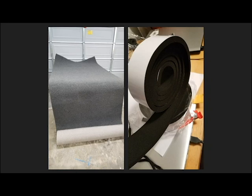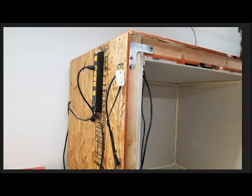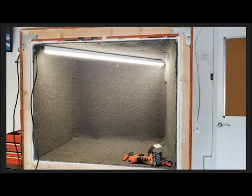I got some of this in quarter inch and some in eighth inch, and I used a combination of those two to create a very good seal around the door. The door has its own little power grid — that's where things like the lighting and the vacuum got wired. I put switches on them so I can independently operate the vacuum and the lighting, and later on the water pump too. Every single corner is glued and caulked, and some are even foam filled to make sure there are no voids anywhere.